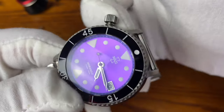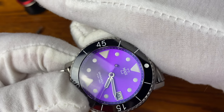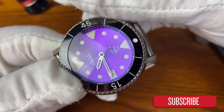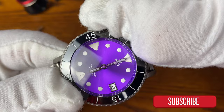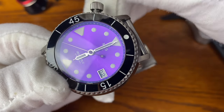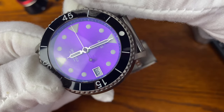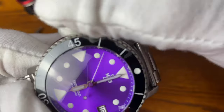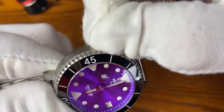The screw-down crown really has no difference in water resistance — I actually learned that recently from the Swiss Watch Company, who did a video on that on YouTube. Really the screw-down crown is to protect the crown itself. We turn it to pop the crown out to the first position. First we want to set the time to 6 o'clock — that's when the date wheel is not engaged, and it can be 6 p.m. or 6 a.m. This ensures you can operate the date function without stripping the teeth or gears of the date wheel. This is your safe zone. It clicks over very nicely — it's a Seiko NH35, it's a workhorse. Winding it is very simple, then you just press it in and turn to lock the crown.